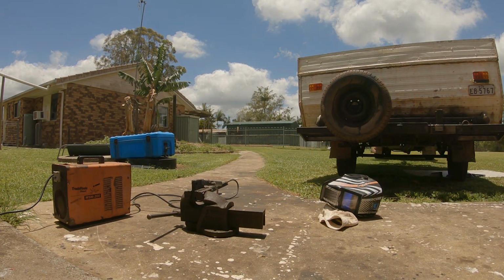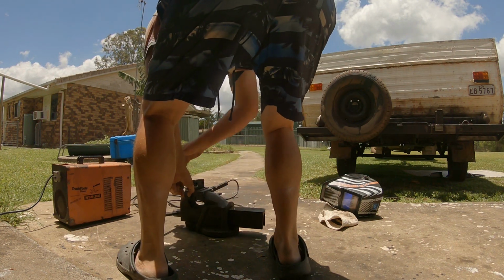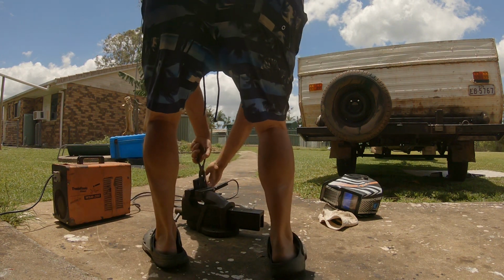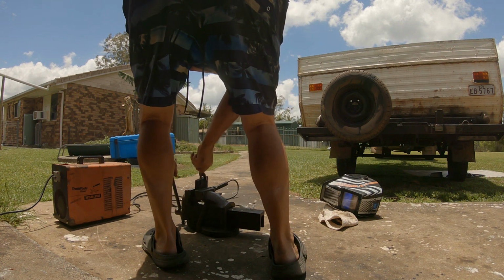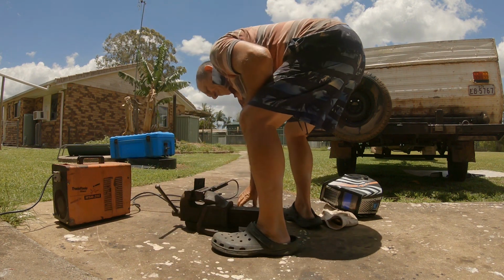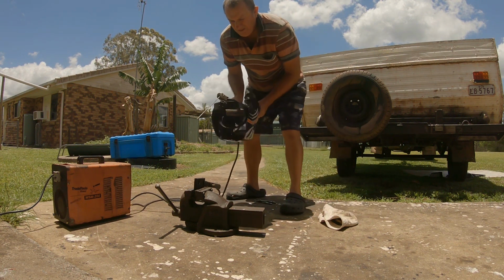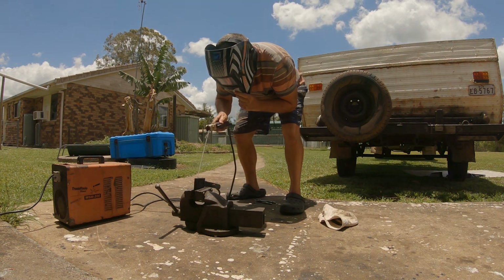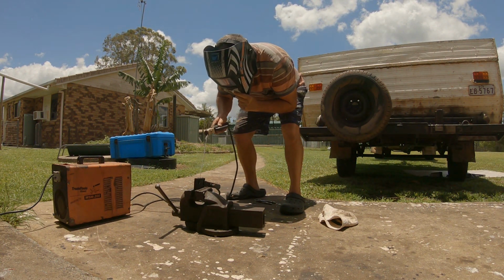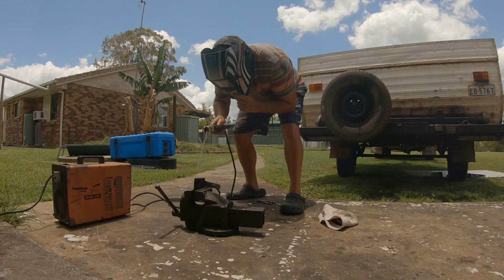I'll be back. This is a little cheap Renegade Trade Tools stick welder, buddy in Alberta. Cheap as anything to pick up. 200 amp. Beautiful to weld with. Just spot him around a couple of spots because I don't want him to move because the holes are all lined up. Imagine trying to get that to work with that oil on it, because I rust-proof the car.